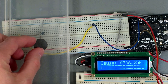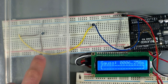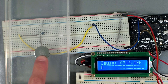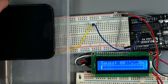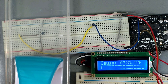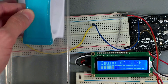Starting with the small circular ferrite magnet, it peaked at around 103. Next up the little bar magnet, which peaks at around 231, confirming it's slightly stronger. After this, the teeny tiny neodymium magnet — whilst it's quite powerful, at this distance it barely registers anything, peaking at around 25. Then we have the medium-sized neodymium magnet, which seems to peak at around 187. And the larger one, which I'm surprised only reaches about 193. Now the iPhone — it's a little bit tricky to measure, somewhere between 40 and 80-ish, though I did momentarily see it hit over 100 for a fraction of a second, so it might be stronger than that. And lastly, the crazy fish tank cleaner — it actually has two magnets inside: the first peaks at just over 700, and the second at 913, which I think may have maxed out the sensor, so it's probably even more than that.